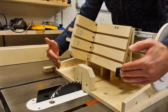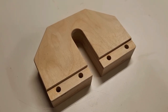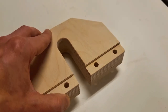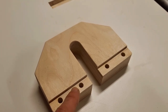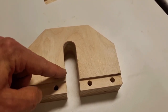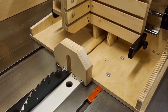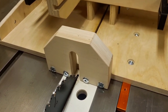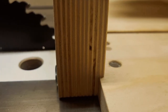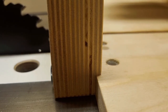You don't have to extend the entire base plate — only this portion here where you have the front support. The third solution would be to make an alternative front support that mounts from the front rather than from the top, which gains you about 25mm. I just made one here — I routed a rabbit that you see here for the right and left side of the jig to land on so these are aligned, and I made a much bigger cut-out that makes it easier to see your layout lines from the front. Mounted to the jig this alternative front support sits with four screws from the front, and in the base of the jig I have four cross dowels. You can see the routed rabbit from the side — this is where the front support lands on the jig's base and aligns the left and right sides. With the same angle of 15 degrees and the same 50mm piece of wood, using this alternative front support gives plenty of margin.